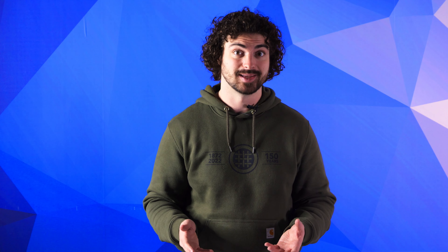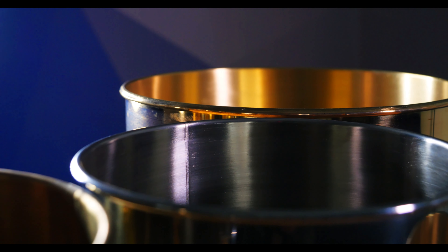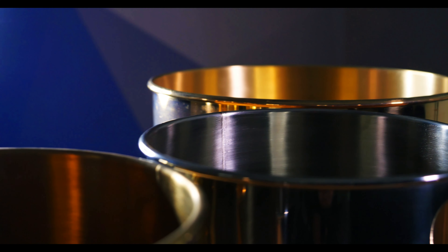The mesh is the most technical and important part of a deep frame test sieve. The most commonly used types of mesh are stainless steel or brass woven wire mesh. The opening size ranges from four inches down to 635 mesh, or rather 100 millimeters down to 20 microns.